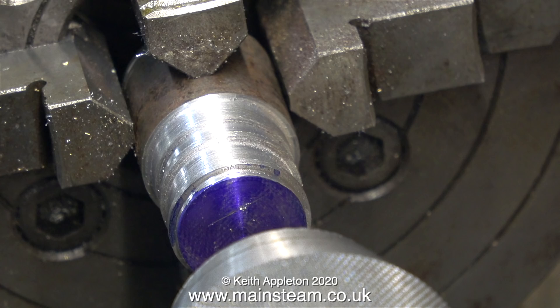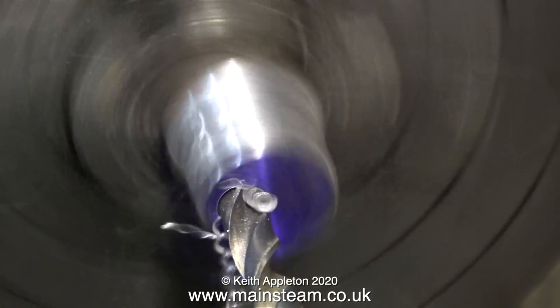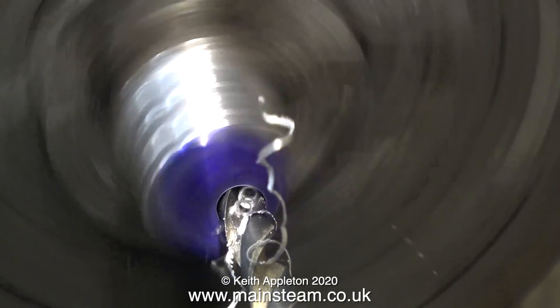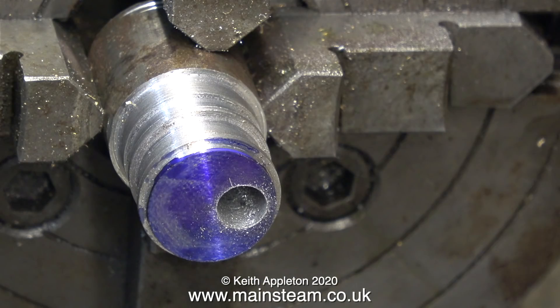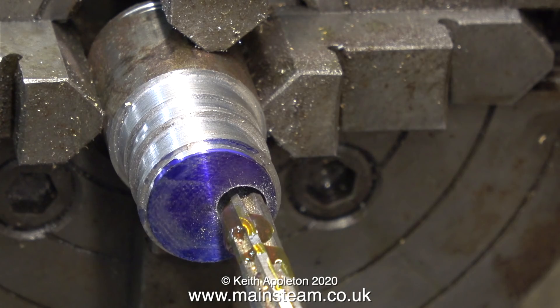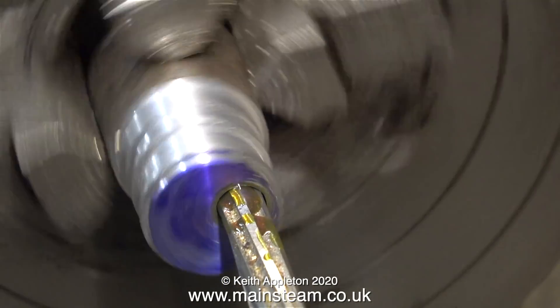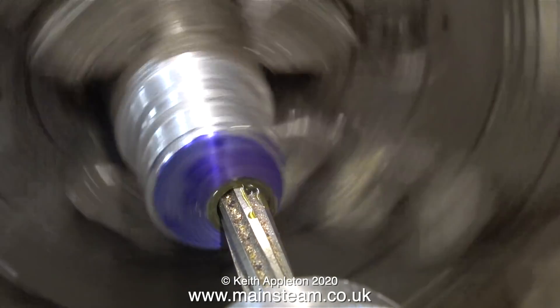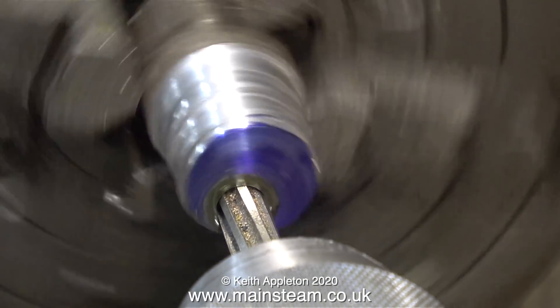Only when I get that part right do I turn on the power and centre drill the hole. Once I'd done that it was time to drill the hole using a twist drill which is one imperial size under 5/16ths of an inch. You will notice now that the part is running eccentrically, and slowly and carefully I drill the hole until it looks like this. If the part is small it's okay, but if you're using larger parts and spinning them eccentrically you need to go much more slowly. Now the lathe is in back gear because I'm reaming the hole — this is a 5/16ths of an inch diameter reamer. All being well I should end up with an accurate 5/16ths of an inch diameter hole all the way through these two eccentric sheaves. When reaming it's important to go slowly; if you go too fast the hole's likely to be oversized.